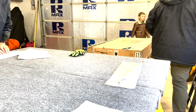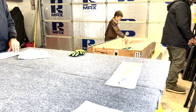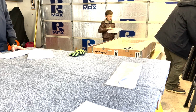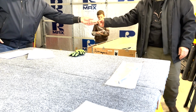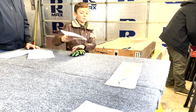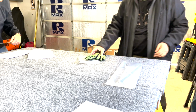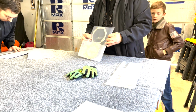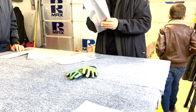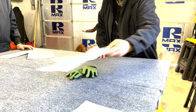So we did find 1/8" dimple dies, and I ordered those online. These are very special. Apparently, they're 120-degree dies, where most of the dimple dies that you see on the aircraft builder sites are 100-degree dies. So we found the 1/8" or 3.2 millimeter. However, it seemed pretty impossible to find the 4.0 millimeters. So I was very glad that Midwest Sky Sports offered to lend us a kit of their dimple dies so that we can get started until the back order dimple dies arrive.